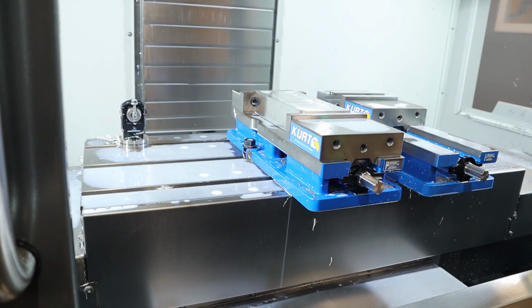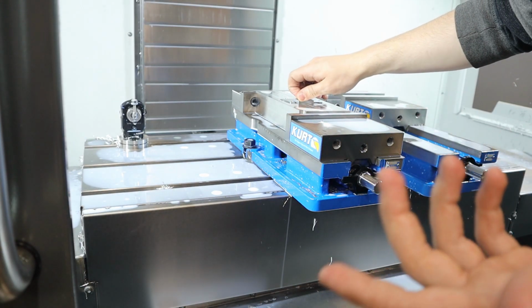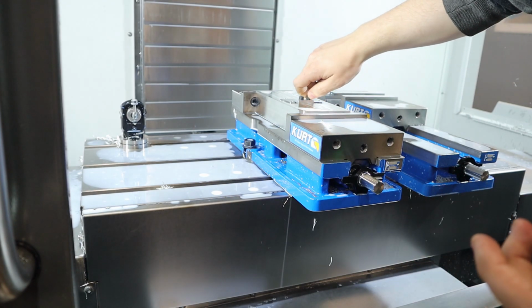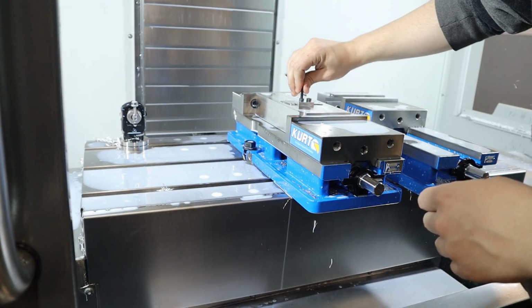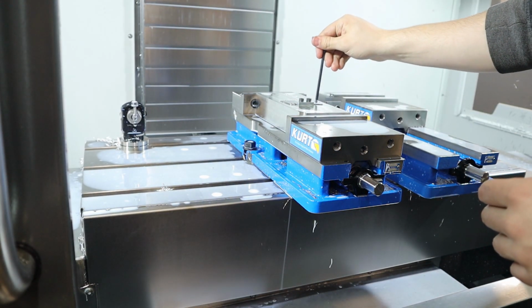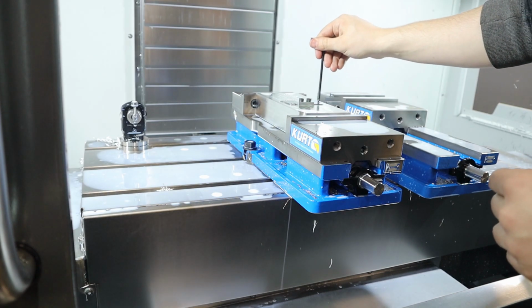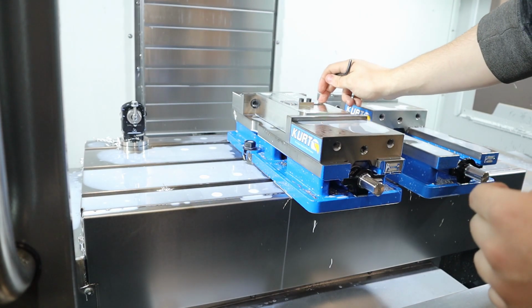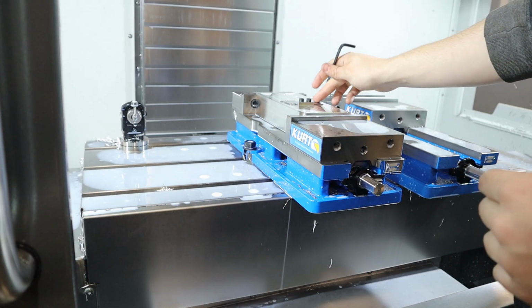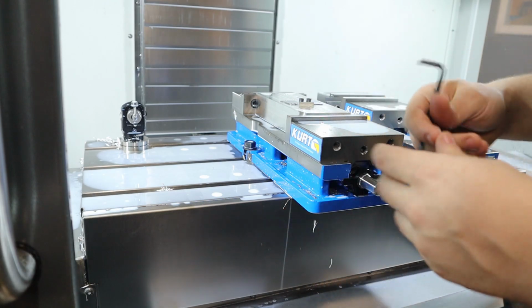So yeah, let me clamp this up. We'll let her eat, and then I will go inside and spend multiple hours stringing all this garbage together. Alright. The clamp barely clamps onto it because obviously I modeled it with a little bit more material, so I think we'll be okay though. So it's got some bores to do. It's got a bore at the bearing, or the washer pocket, but like I said, it's supposed to be 10 thou, so the end mill might not even touch it. That's why I didn't touch it on the other side.